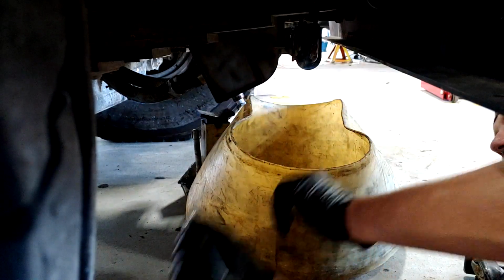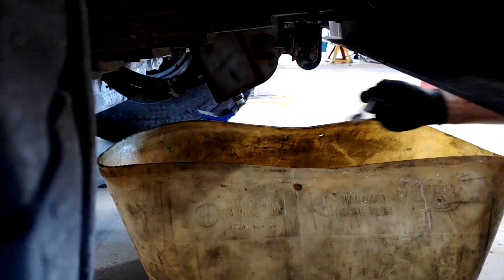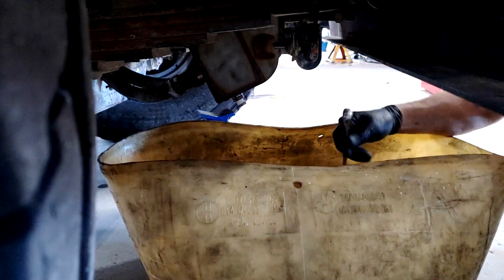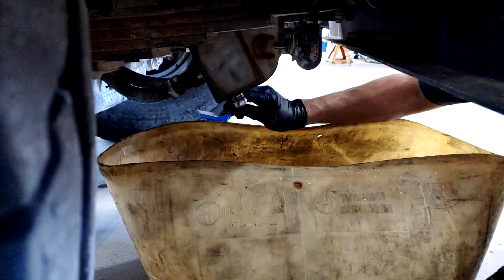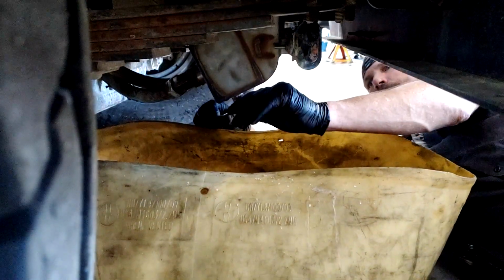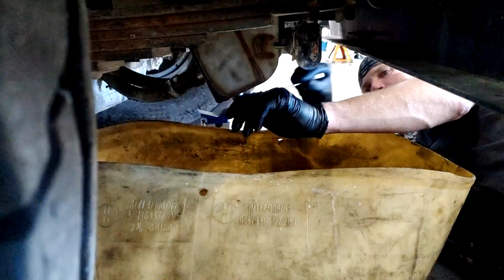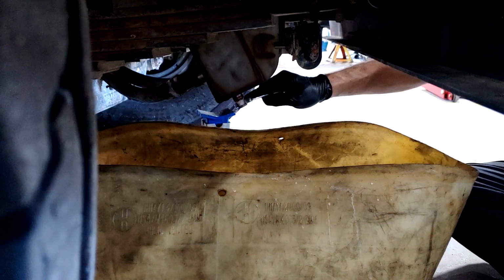It wasn't very tight. It might already be drained. I don't know, I didn't start this process, I'm just finishing it. You can tell that whoever did this doesn't do this on a regular basis because there's Teflon tape on the drain plug. At least they tried to use something. But you don't use Teflon tape. That was something you did for household plumbing a long time ago.